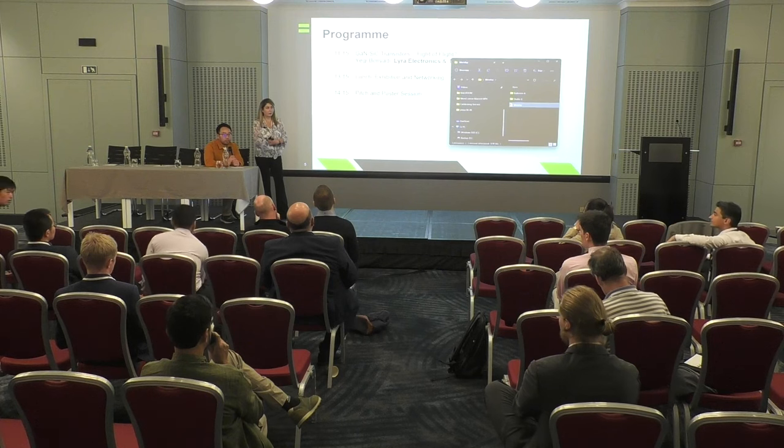On the PCB, currently, there are different tools. Especially if you're doing PCB layout work, you can use what they call a checker. It's based on rules. You basically give the software your Gerber file, it reads everything, and then it tells you, for example, here you have a break in the ground plane, and it will analyze if there's any signal line on the next layer. If so, it will say, look, this is wrong. That's the current status of what all these software tools can do.